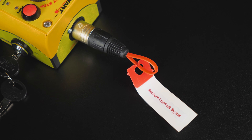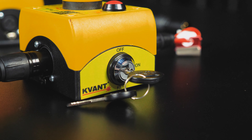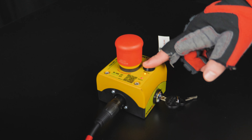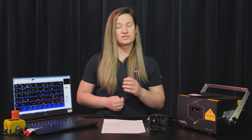At the end of the line is your terminator, usually labeled user's interlock. Put this at the end of your e-stop chain to complete the system. On the e-stop switch, you also have an insert for your key, which needs to be put in and turned to enable. On the e-stop is also the manual reset switch. Lasers in the United States are required to have a manual reset — if the projector loses power, it will not start up automatically without instruction from the operator. This is a serious requirement, and if your projector does not have this, it is not compliant.